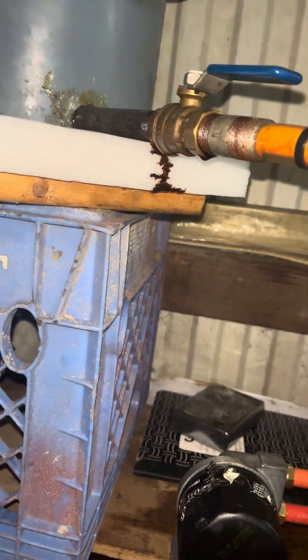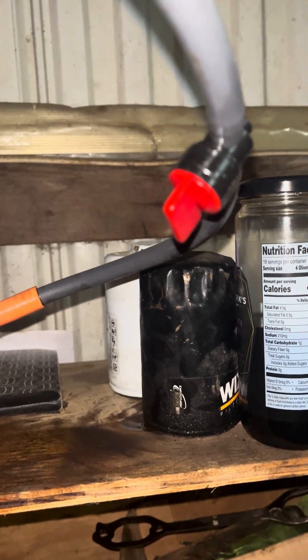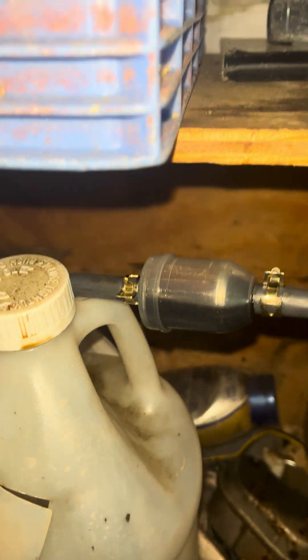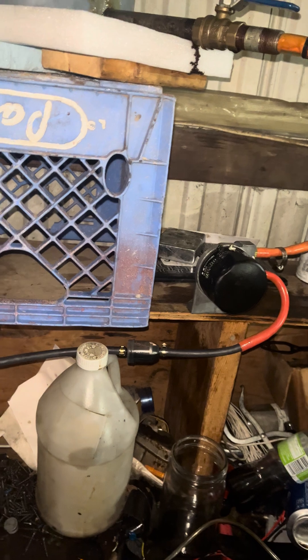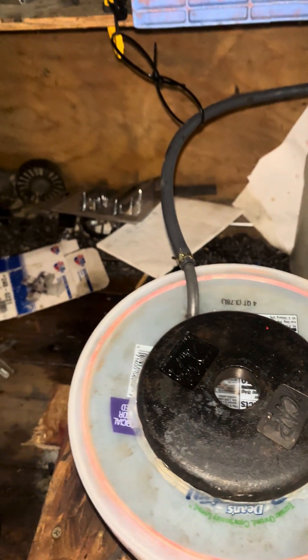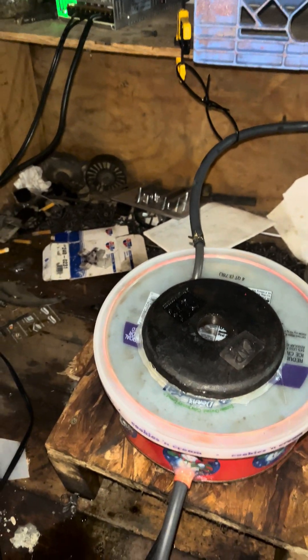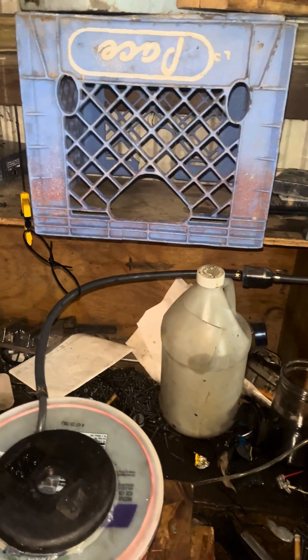It's going through this line here — don't mind the leaking, it's fine. It's going into this filter which leaks like hell because it's broken, but it still works so I reused it. It's going out into that little filter — the more filters the better. Those filters over there are only for catching heavier stuff that the centrifuge would otherwise clog up, so putting those two filters in line helps the centrifuge filter out the smaller stuff.